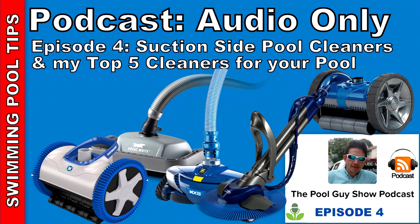If you have an older pool you're going to have to attach the suction cleaner directly into your skimmer, and most cleaners will come with an adapter that allows the skimmer to still work while the suction cleaner is working on the bottom. The only drawback is that a lot of debris will pass through, since you have to remove the basket in most cases it will pass through into the pump basket. There's a way around removing the basket and I'll cover that later in this podcast.